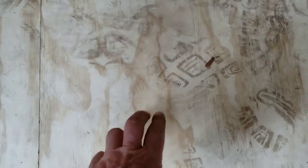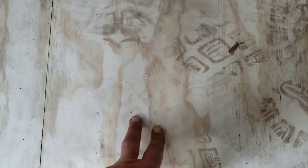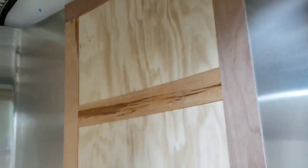Now one thing I'm going to do also when I insulate — people say they don't bother, but I will. This is three-quarter inch plywood and underneath is nothing. It's not even treated. You just have the frames, the joists so to speak. Underneath it's not even treated, so as soon as this starts getting wet it's starting to rot. So that's going to have to be insulated and covered over with a material — either sheet metal, aluminum or galvanized — and then shoot some undercoating.